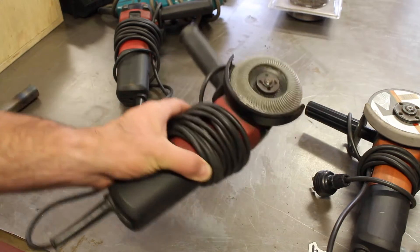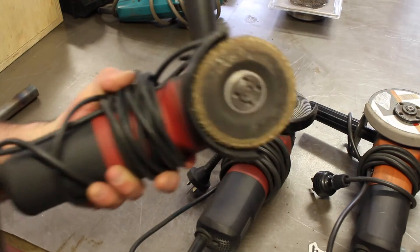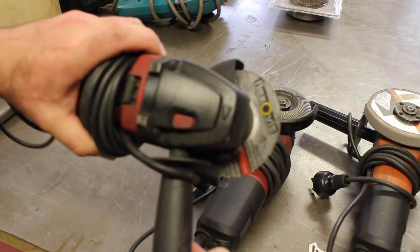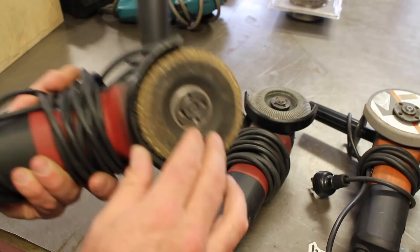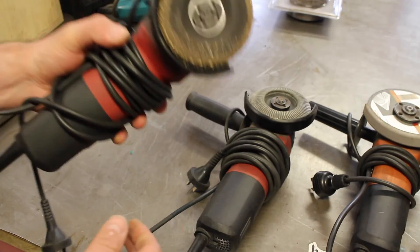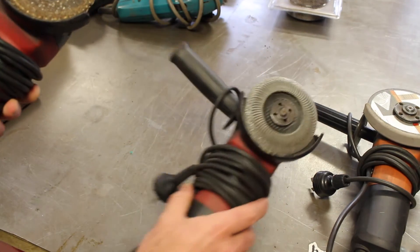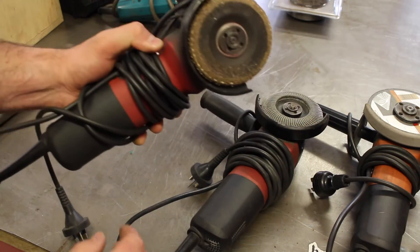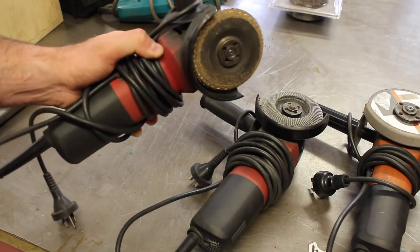This grinder is currently set up with a grinding disc, but I don't generally use grinding discs that often on motorcycle jobs. It's just too coarse an operation for a motorcycle where you need more finesse and don't want to remove massive amounts of material at once. I tend to reach for a flap disc before a grinding disc. A grinding disc I'd use for fab work on heavier steel — maybe six-mil or quarter-inch plate.